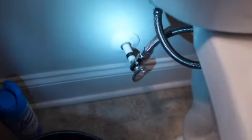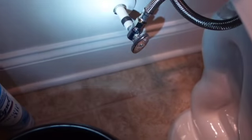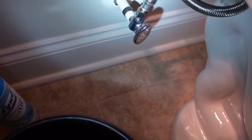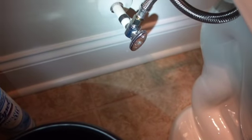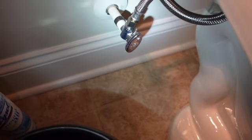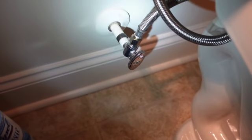And what I ran into here was I had to rebuild all the toilets. They were just rotten, just builder grade. And I had to change every one of these valves because it had those pitiful portable plastic valves that push and pull, and you do that and you're going to be in trouble. And they're one piece, just the cheapest builder grade you could get. Fortunately, the plumber left enough stuff here for me to deal with. So there are those. I had to change them under the sink, under the kitchen, under all the sinks, under everywhere I could find them.